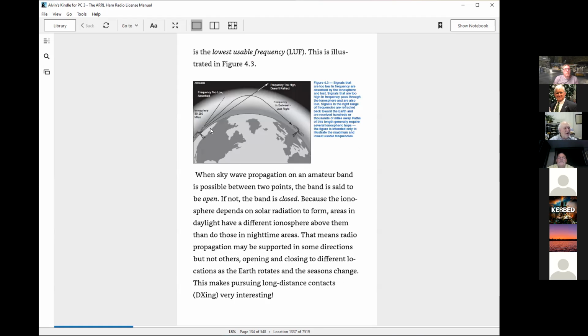I remember a friend of mine in Sterling Heights, which is about 15 miles away, put up a new antenna. And so I volunteered, okay, let's start at one band and we'll go up each band and see how well you transmit. So for 3.5 megahertz, I heard him okay. 7, I heard him okay. 14, I couldn't hear him. It wasn't because he wasn't getting out, but his signal was skipping over me.